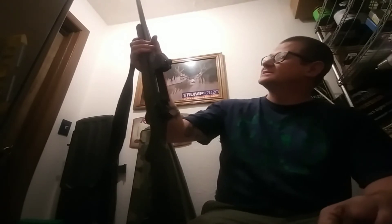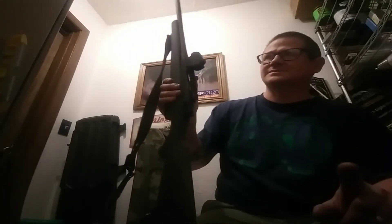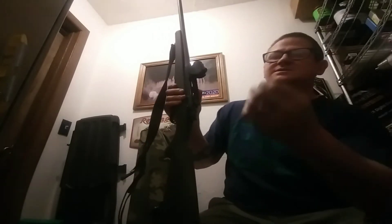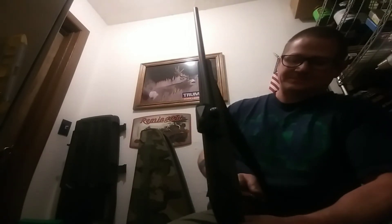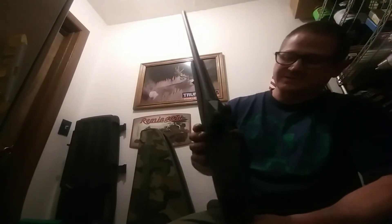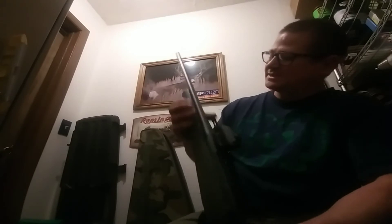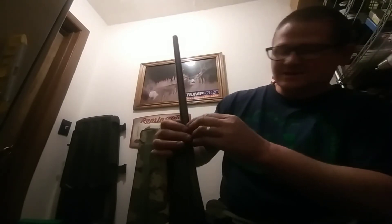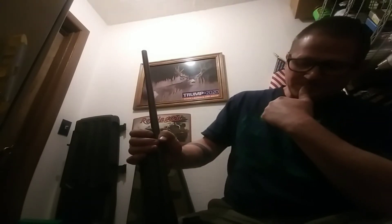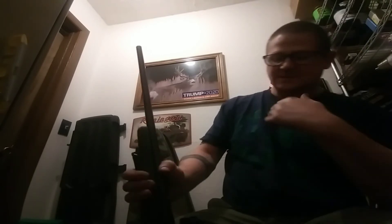But here's a problem I found. I had to bore out and carve out the inletting of this thing and bed it to get it to fit straight in the stock, and it's still not perfectly straight — it was almost touching on the left side with a big gap on the right. That sucked. It didn't fit in there right, and then the next thing — probably even more important — when I take this thing to the range and fire it...